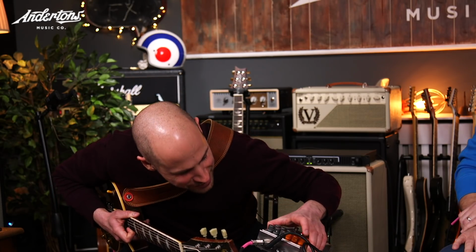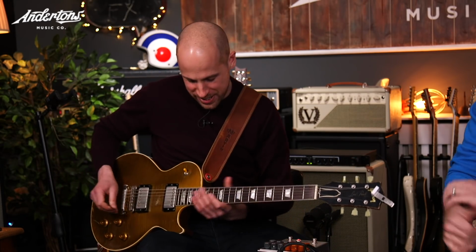Got it. So if I go up from like the 5th fret. Yeah. So definitely hear that. That's based on the pedal having a UK power station in it producing UK mains frequency. Yeah. So the dip switch on the back, I changed that. What, we've gone US, we're going 110 volt now or something. We're going to go US, yeah.